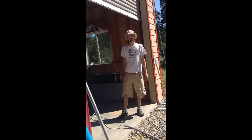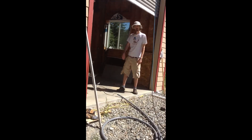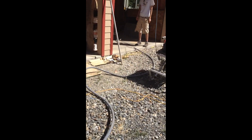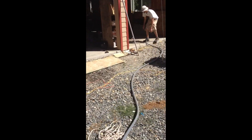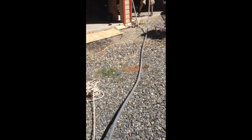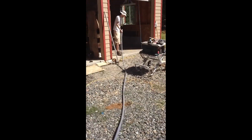We've got to pull our wires through the conduit. We've rigged up this little rope here and we're going to feed it through. As we found out, it's very difficult to push wires through anything, so running something thinner through first so that you can pull your wires. And if you put your conduit out in the sun, it heats up and it's really easy to straighten out. So here we go, see if this thing works.